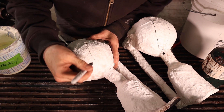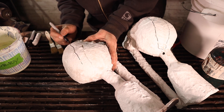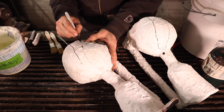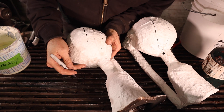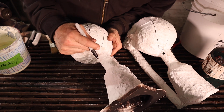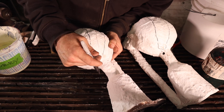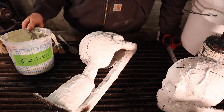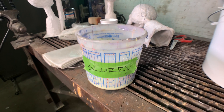I'm going to draw around the crack and come up about an inch above where I think the crack ends. That way, when I'm patching a bunch of shells, I don't have to go back in and re-inspect the shell to try to suss out where the crack is. Once I get in mode with the bright lights and identify all the cracks, I can go back in and start patching. The first method we're going to talk about for fixing your ceramic shells is just using the slurry you used for your original shell.